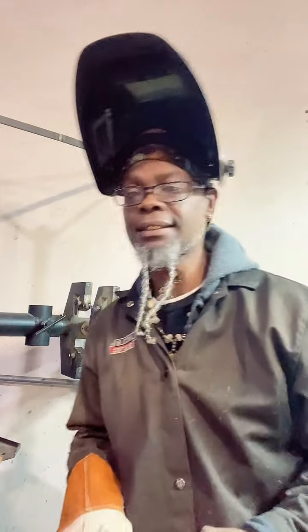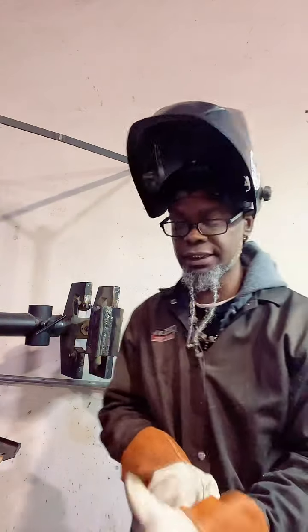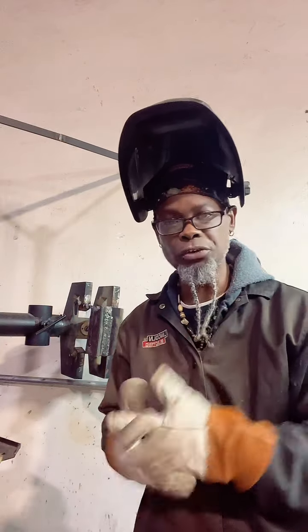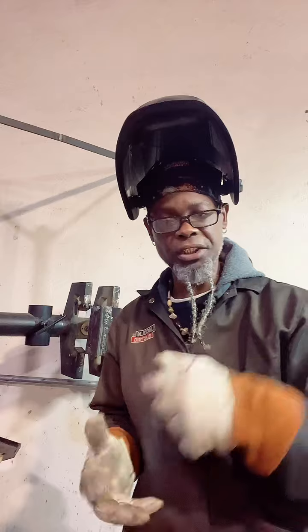Okay, you just finished working on some pipe. Man, 6010 is gonna be just like a 6011, fam. You're gonna have to do some type of manipulation. Circular motion, whipping motion, and keep it real tight.